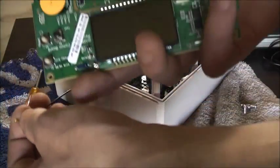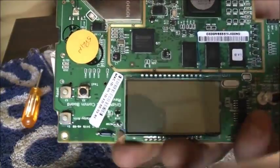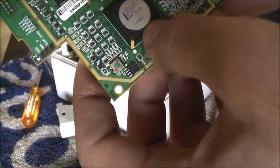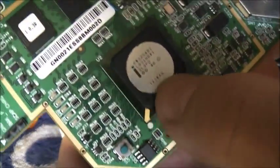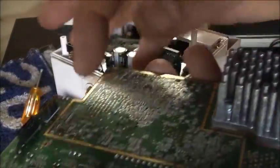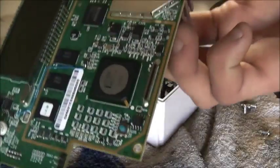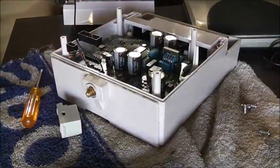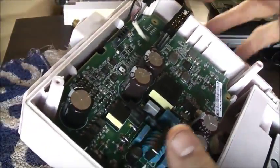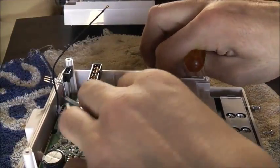Carefully unplug this communications board and unplug that coax cable. Look how tiny that thing is — it's a Wi-Fi type system. And there's the brains: it's a Taiwanese main chip, that must be the brains for this meter. There's a little test connector there. No shielding on that. That heatsink would be like a GSM modem chip on there — it amplifies the signal with such power there's a heatsink that big. Bloody hell. The Landis+Gyr E350 smart meters aren't even that powerful, so this thing might nuke someone's brains out.